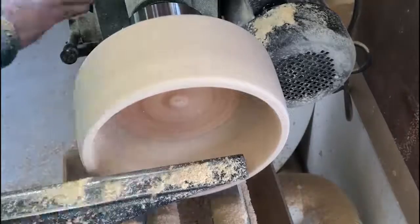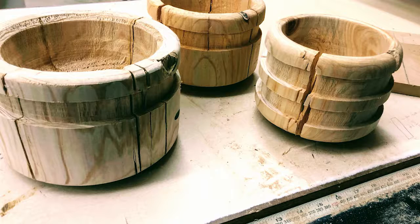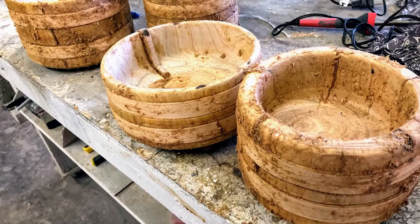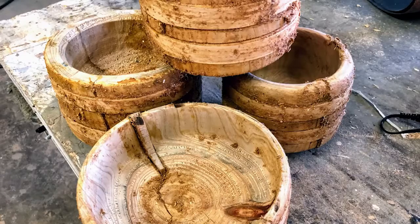The only problem is that they went ahead and cracked, and as they started cracking I realized I couldn't use them, so I went ahead and put them on my table saw and rabbited out two slots in each bowl. I glued them up and ripped down some little thin pieces to go inside those dados and glued them and filled in some wood where it needed to.